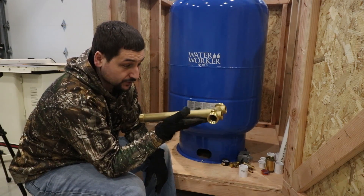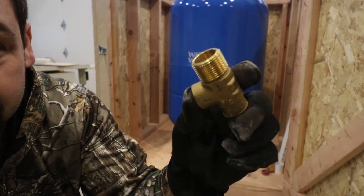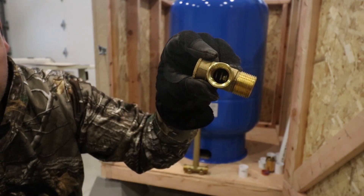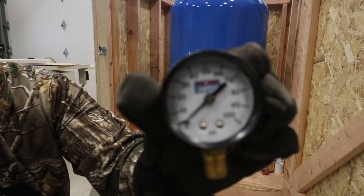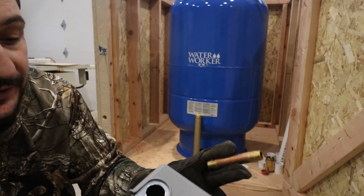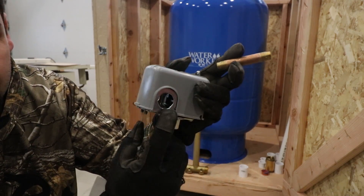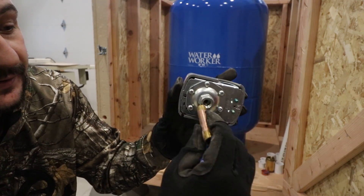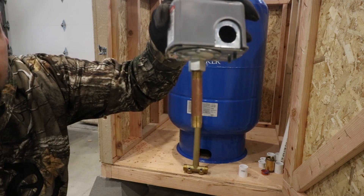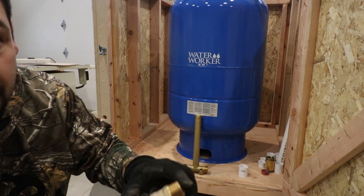This comes as a kit — I'll put the link in the description. So this adapter, which is a pressure tank T-assembly, is an inch and a quarter. It comes with a relief valve — this end threads into the adapter, and this is where the water would come out if this were to blow. A zero-to-100 pressure gauge threads into the adapter, along with a four-inch piece of quarter-inch pipe. This connects the pressure switch, so there'll be electrical coming in and going out to the controller. And then a dump valve. So all these components get threaded into this adapter.